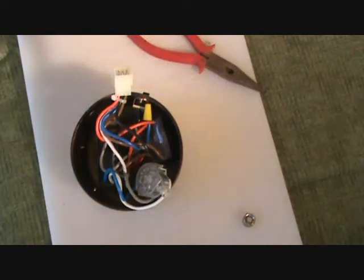That pull chain means nothing to me, because this particular ceiling fan is controlled by the ceiling fan switch on the wall. Do you remember? So I don't care about this pull string. That pull chain just gives people fits. You know, you're almost better off cutting it off or pulling it way up high or something, just forget that you even have a pull chain on your ceiling fan. If you've got a ceiling fan switch in your wall, the only thing you got to remember is that ceiling fan has to be in the high position so that you then can control it at your fan switch in the wall. Very important that you remember that.